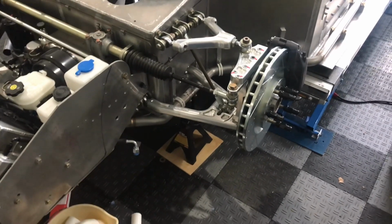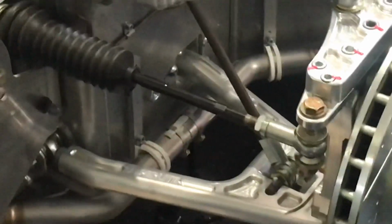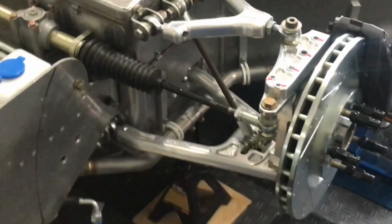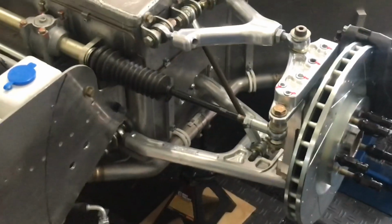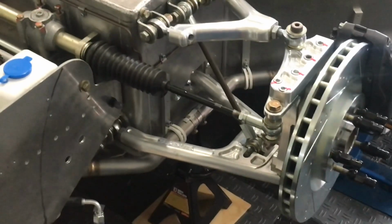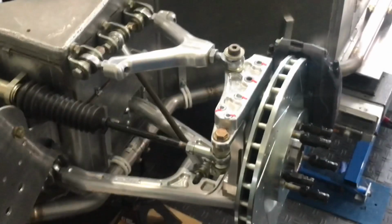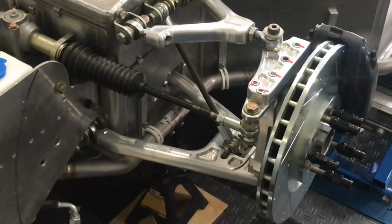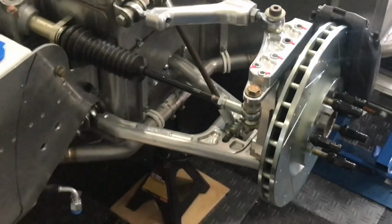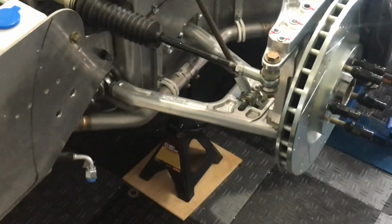Okay, well, I think this is worth showing. So let's see, these are the front tubes, so moving over to them, and like I mentioned, I had the professional welder weld up some of these tubes, but they were all just sort of straight welds, so nothing needed to be aligned. But in this case, I need to align this front tube with the rear part of the front tube, and I made a little bit of a splint or a pipe clamp out of a couple silicone tube clamps and a couple pieces of aluminum.